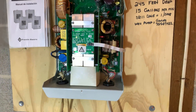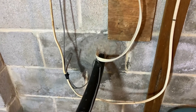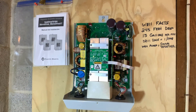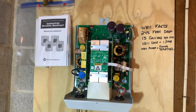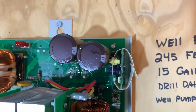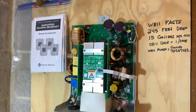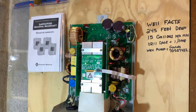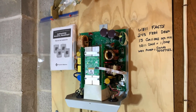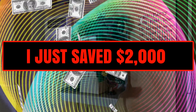He told me that what I did was absolutely correct in regards to fixing it. So the general consensus is that this thing is fixed. If anything goes wrong in the future, I will certainly document it. Thank you very much for watching. I hope this video has helped you. Don't be afraid to get in this thing — just make sure when you turn the power off, you wait at least five to ten minutes so those two capacitors don't blow your head off. They are very powerful. Consider wearing rubber gloves before pulling this card out. Best wishes, and I hope this saved you some money — this has saved me $2,000.